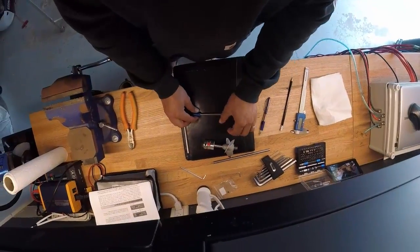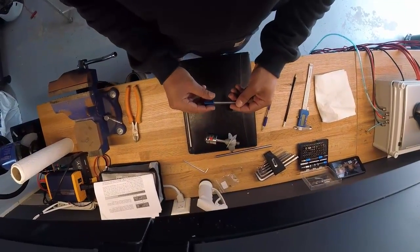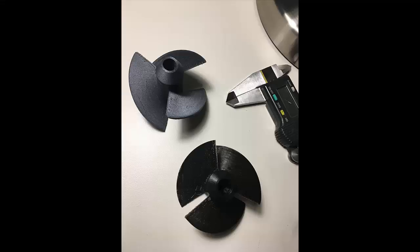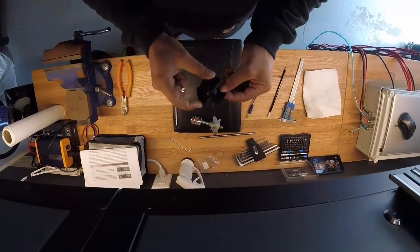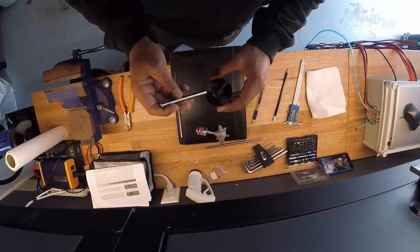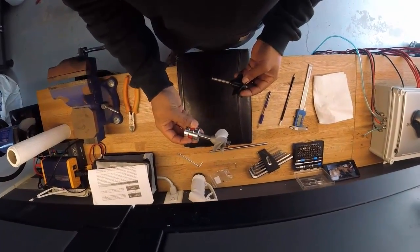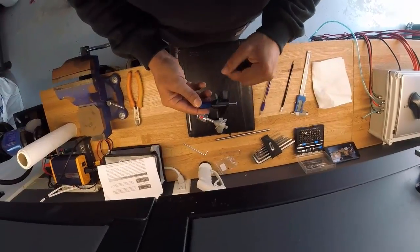We are converting the 11mm shaft to an 8mm shaft. The coupler is a fraction of the size but can hold the required torque. We've got a carbon impeller coming — we've changed the hub dimensions so it fits an 8mm shaft. By downsizing the hub we're gaining more blade area, which acts like a much larger impeller and gives more potential thrust. The whole thing is going to weigh about 50% lighter than this setup, which is significant.